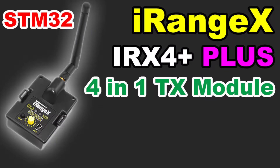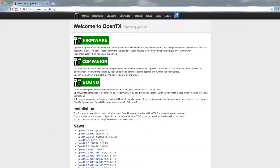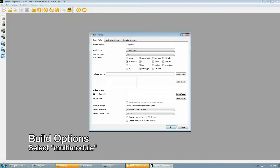If you already have one of the 4-in-1 modules like the IRX4 Plus, you probably don't need the IRX1. The IRX1 module runs in serial mode unlike other single chip modules which run in PPM mode, which means you'll need firmware that supports it. I'm using OpenTX, which will work with it. This should work with the FRSky Taranis and the Turnigy 9XR Pro as long as they run firmware with multi-module compiled in. In this video, I'll show you how to download and install OpenTX with multi-module support, set up a simple 4-channel configuration, and bind it with a quadcopter.